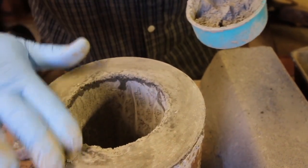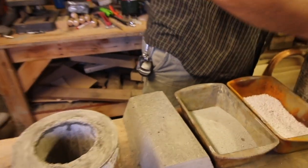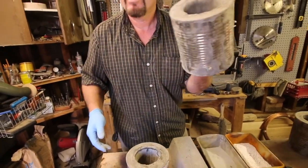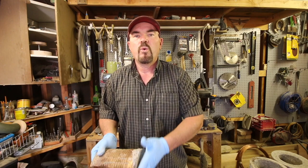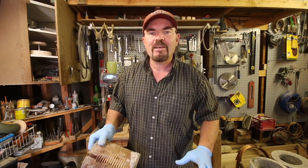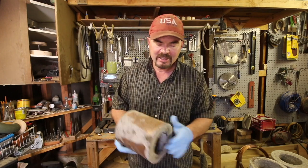After I got the rocket stove going and put this riser on it, it got hot and it just sealed them. Look at the inside of that - this has been subject to about 1800 degrees for hours last night. I ran this thing on two separate occasions for at least four hours at a time with white-blue flames shooting through it. The insulative properties are insane - right above the vortex chamber where it was around 1600-1800 degrees, the most I could get on the outside of the can was 160 degrees. Freaking crazy - as an insulated riser it works awesome.